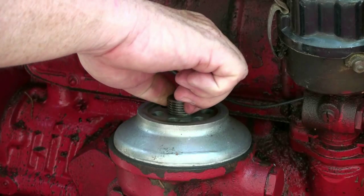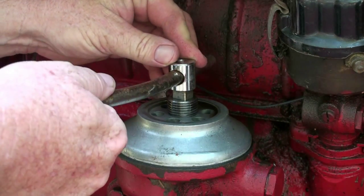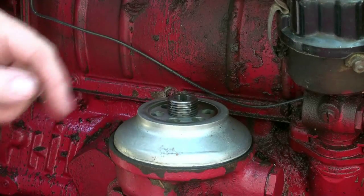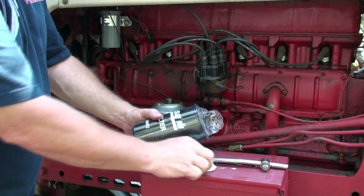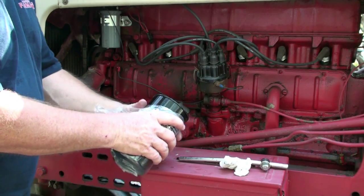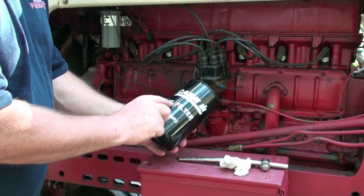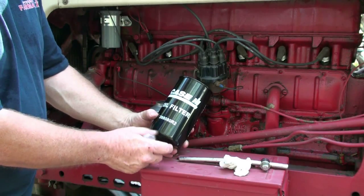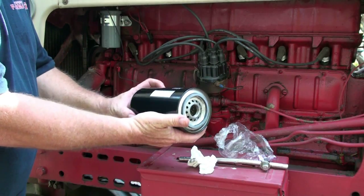See, this has come unscrewed — this is one thing I love about these spin-on filters, but I don't like the way this centerpiece likes to get loose. There, that should be good. I'll be right back. Okay, as I said, I had the CarQuest. I'm going to go with the CarQuest 85797 out, and now we're going on with an OEM filter — Case IH oil filter number 3980800R2. For those of you who didn't get that: 3980800R2. This is what we're going to put on there.